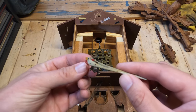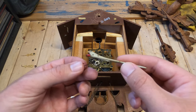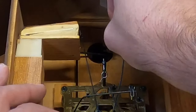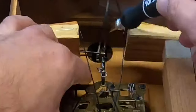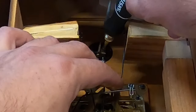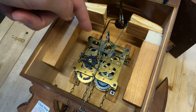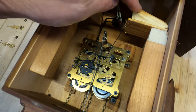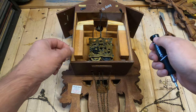It's so cool how intricate and detailed this cuckoo clock really is — this is one of the most fun things I've ever had to fix. With the door open, I want to get that little hook inside the door and tighten that down with a flathead screwdriver. We've got everything lubricated on both sides of the gearbox and the supports attached to the appropriate bellows. Now let's tighten down all four support screws.